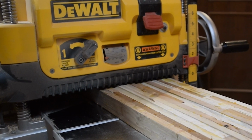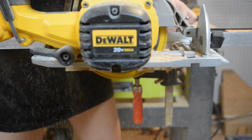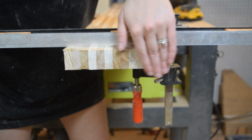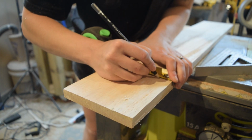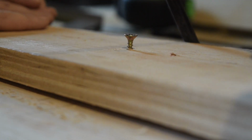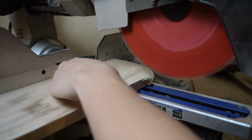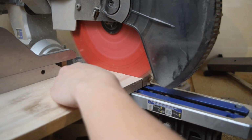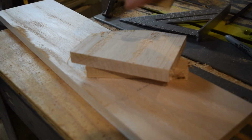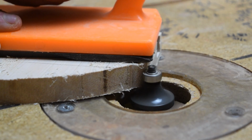I used the planer to clean up the uneven surfaces. Then trimmed it down to size. To get started on the supports, I used a circle cutting jig and the router to cut the curved edges. Then cut them down to size. Added the slots for the skirts, and finally gave them a round over and sand down.